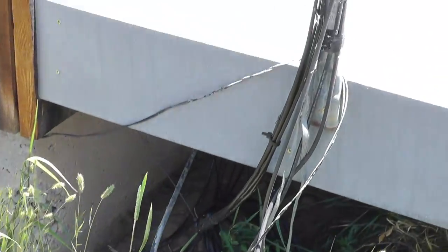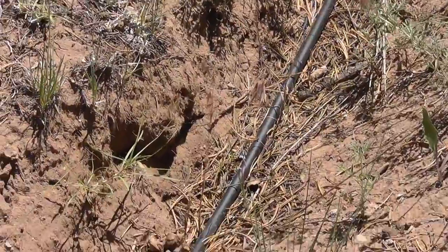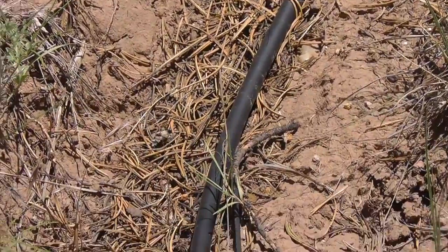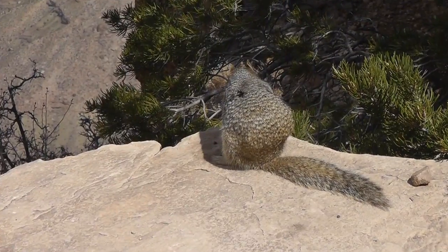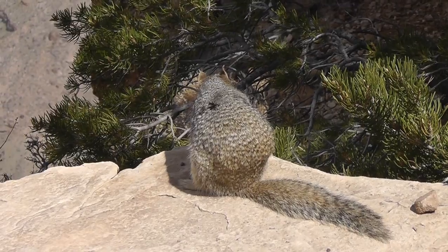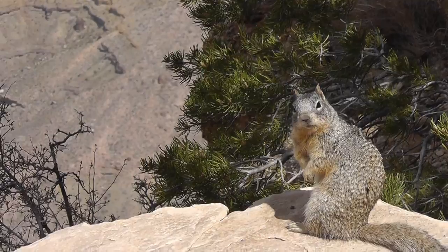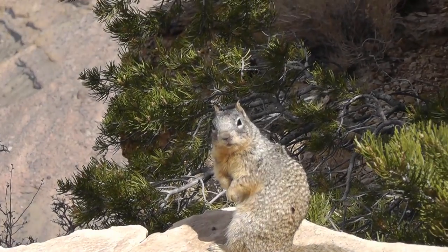Most coax cable is okay in the sunlight. Some is rated for direct burial, meaning it can run underground without being inside a protective sleeve or pipe. Do be aware that there are some crazy animals out there that like to chew on cabling, so check your coax from time to time. And don't hang coax by the connectors. The connector can pull loose. We'll discuss choosing and mounting an antenna next week and how to deal with situations such as limited space and balconies.